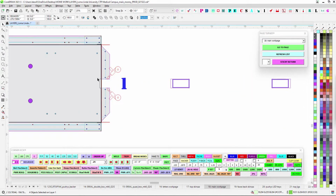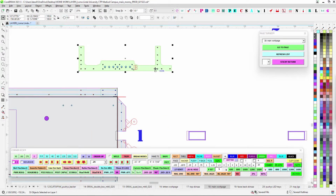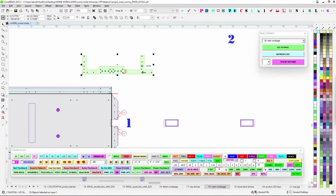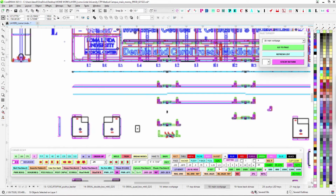I'm trying this because this thing was going to compromise that patch anyway, so I just tried it this way. Then I took 2 jigs that we would use to put the verticals in, and I welded that together, and I also brought this together. So now this is going to be a 2-purpose thing, where it's a jig that welds this together, and then also that'll be ready for the verts. You can see right there.